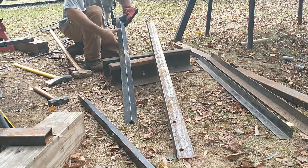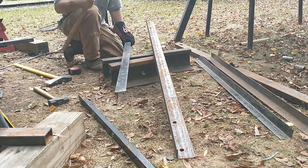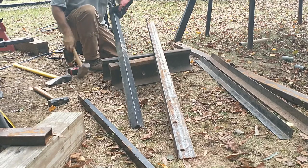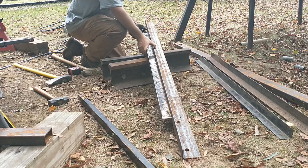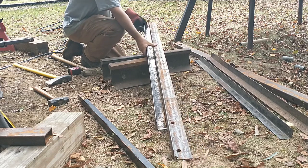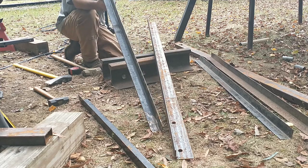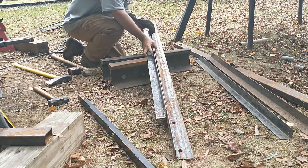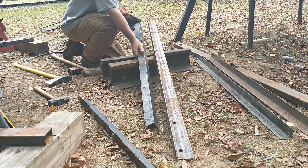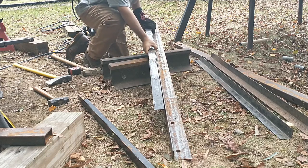There's a little gap right in here. I think we need to hit. Right. I'm gonna hold this up against the straight edge. Oops. Guess I won't. All right. It's about an eighth inch out. And this flat against here, it's about an eighth inch. Holding it here, as you can see, what was about 3/4 inch down there at the end is now not even a quarter.